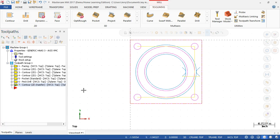So machining the backside off, we said we had a quarter inch material. I've been kind of jumping around that. Really, we can do the facing operation. We can possibly put in another face with the half inch end mill to run across and rough off the material, and then come back with the facing to remove that material. So that gives us a couple options.